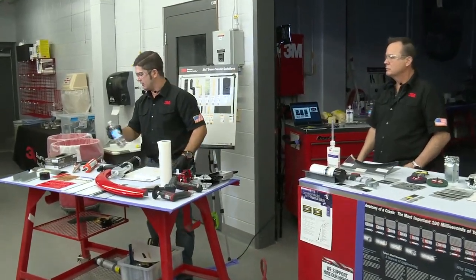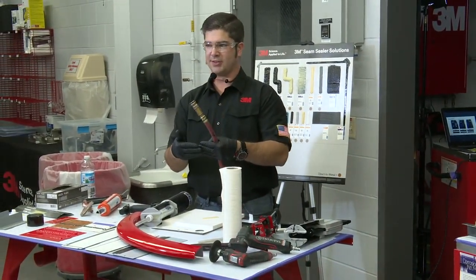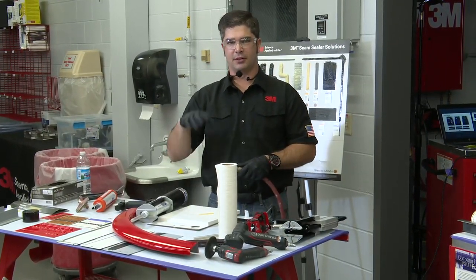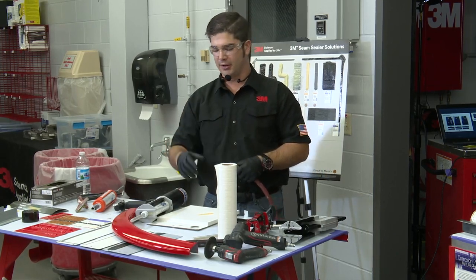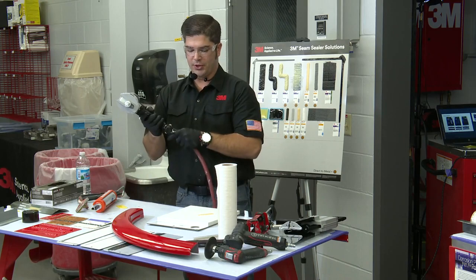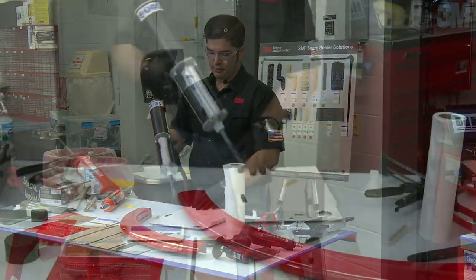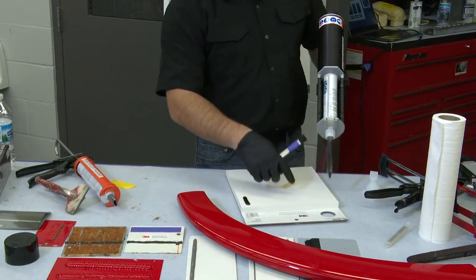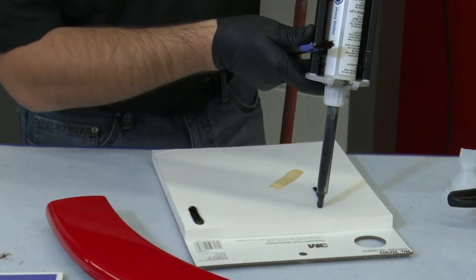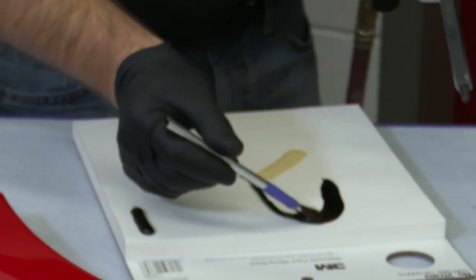In some cases where you're getting panels that are very dissimilar, I like to use this reference, like the Lexus Toyota rear body crush cap areas. We absolutely do recommend, when you're going to try to replicate that look, that your first step would be, if this is our crush cap, and I'll just draw a figure around here, that I would seal that seam first.